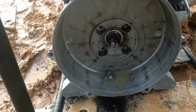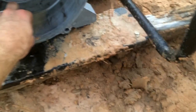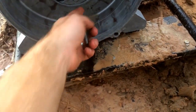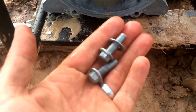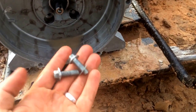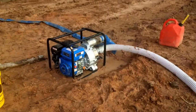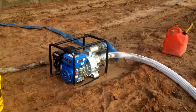Brand new pump — I showed y'all how it was leaking behind this housing. Got the impeller off, two bolts that go in here that hold this housing onto the engine. They were completely out and jammed up inside the bolt hole. The threads on them are pretty boogered up; I might be able to get them started back in but I kind of doubt it. I'm gonna try to torque the heck out of the other two and maybe just run it with two bolts. I'm taking this thing back anyway — they have a 90-day guarantee and they owe me on this one. Two bolts out, the other two were loose so I tightened them as much as I could without breaking them. It's all back together now and it's picking up water.